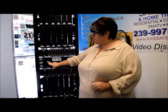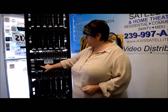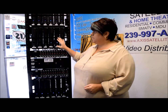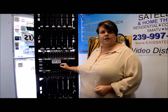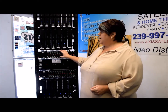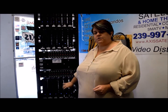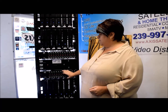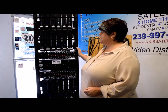If the overall gym is down and you're not getting anything, look to see if this power light is on and if it's getting the amplification that's necessary. If you can do some of these troubleshooting things before you call us, it allows us to determine when we need to come out and help you versus what you can do to continue troubleshooting. This entire rack does have 24 channels — there's another bank of 12 receivers at the bottom along with another mini modulator chassis, and that's the overall workings of the rack itself.